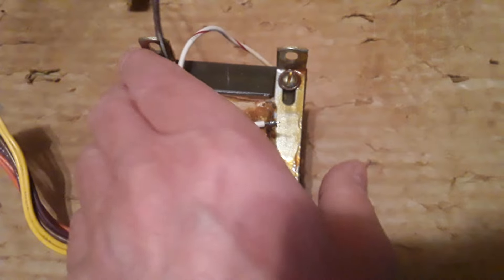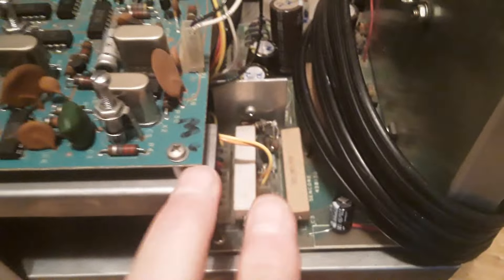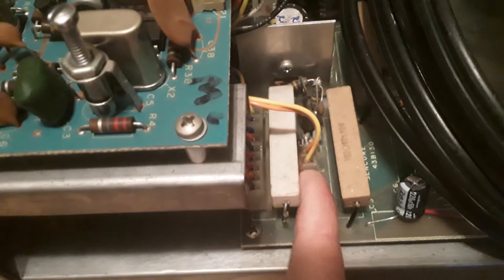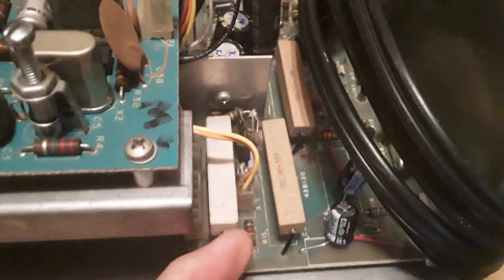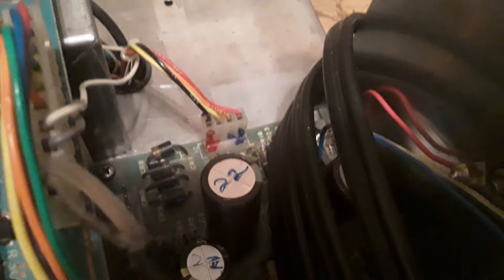I put it away because I didn't hardly use it, but I used the peak-to-peak settings on it for measuring the voltage on the cathode of the picture tubes — adjust it to 50 volts peak to peak. Then I also noticed these were cold. I remember thinking this is so close because this one gets really hot when it's running — these are the capacitors I put in. I'm going to pull this out; it's just four bolts and it's got the big transistor TO-case-3 on the back — I think that's for bias adjusting.